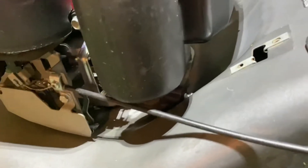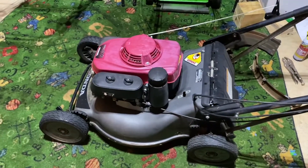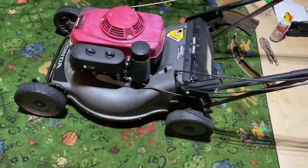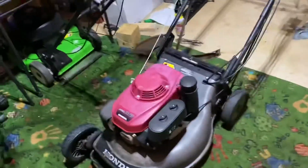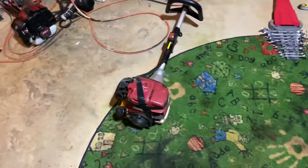I'm guessing because the pin off the drive shaft just came out. I tried to fix the self-propel on the drive shaft — I put in little nails to find out — and that sure enough was the problem. So I have to get a roll pin for it if I want to use the self-propel. This thing still runs and it runs pretty good. I might film a long-term video at one of my clients' houses and feature this more.